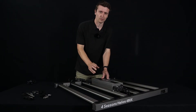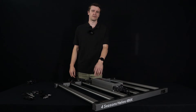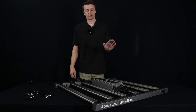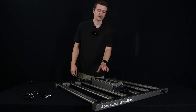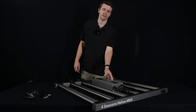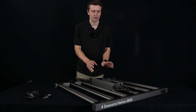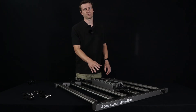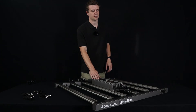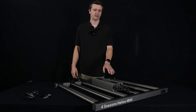Inside the driver box — the beating heart of the LED panel — Four Seasons has opted for a Sosin 480 watt driver. We've been doing some tests with the Sosin drivers and they've proven to be very effective, very reliable, and of course have good power factor correction. They have thermally mounted the driver to the box, so what you can expect is that the box is going to get rather warm — it is rejecting heat from the driver inside, keeping it running cool and reliable. Four Seasons have got a bit of length on the cable meaning you can disconnect this box and put it elsewhere, and they're going to be offering the option for longer cables, using high quality cables to minimise voltage drop.